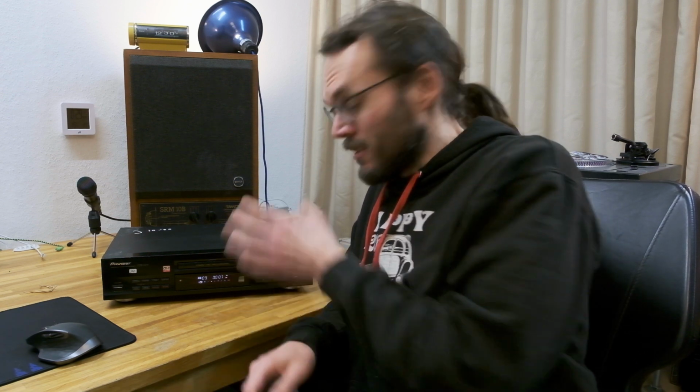Playing some royalty-free music. This CD player has what we call a line level output. And you may have seen a little sign saying line in or aux in on many devices. These devices accept a line level input. Now, most of the things you would use have a line level output. CD players, computers, cassette decks, your phone. It's all at least sort of line level and it's all compatible.